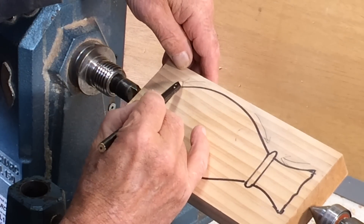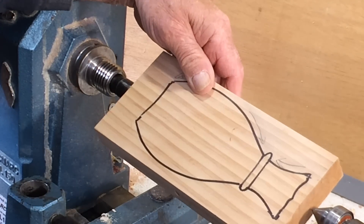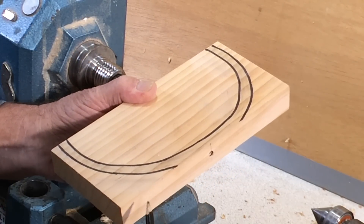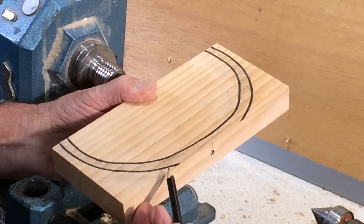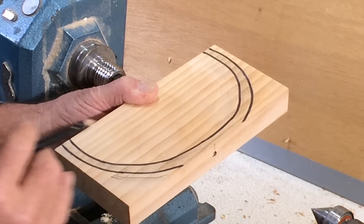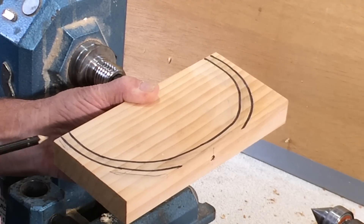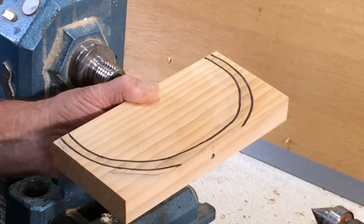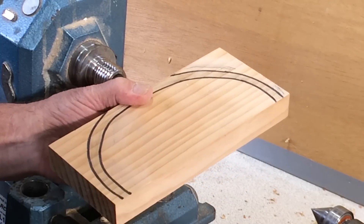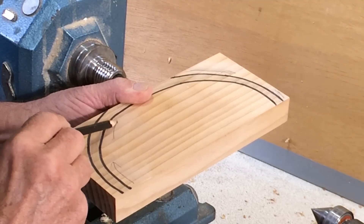Now if we have a piece of wood being used for a bowl, the grain is in a different alignment. The cuts here are from the smallest diameter up to the largest — going that way and in from the rim — because if you go the other way, this end bit is likely to splinter off. When you turn it around and start to hollow, the cut comes in this way and all the way round to the bottom.